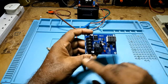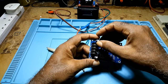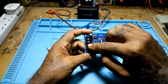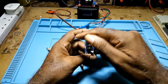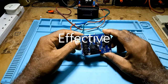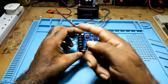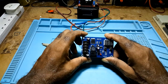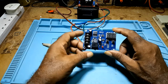When the battery is connected, the negative terminals are connected together and the positive is separated. When connected to the battery, current would slip and reverse. For this to work properly, you would need to put a diode right here to block the current from going back into whatever you're using as a charger.